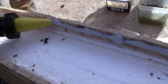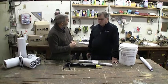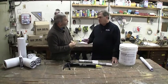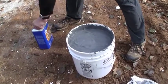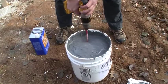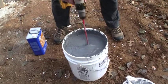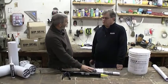So we're basically laying down the flashing material and then mixing up just like you would mix up a 5-gallon bucket of paint, I'm assuming, right? Yeah, and it has the ability to be thinned a small amount with mineral spirits. Not water, mineral spirits. With mineral spirits, and that will, depending on how long the material has been on the shelf and what the temperature is, you can loosen it up a little bit so it rolls better. So it's not really different than any of the other commercially available liquid applied membranes, other than I've never seen this material being used with some of the other membranes.